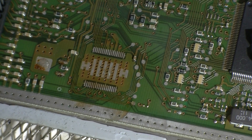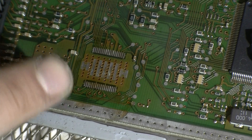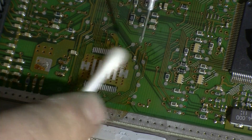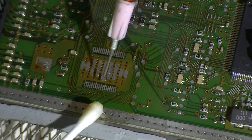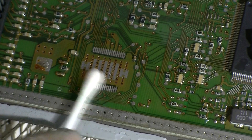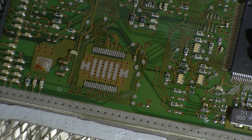There are two ways of reapplying this IC — we could use solder paste underneath. This pad probably just extends across and we do have a lot of connection points underneath, so I'm not too worried. It's very important to get rid of the old flux before you attempt to solder on a newer chip.